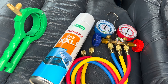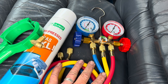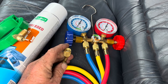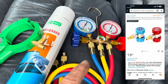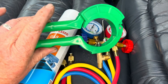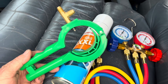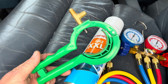This is what we're going to be using to put our gas in. We've got an old set of manifold gauges — only cheap but I've had them a while. They've got the R22/R12 fittings on them. You can get adapters to fit R134A systems, which are a push-fit with a threaded Schrader valve connector. We've got our side puncture can adapter, which I bought from eBay. You can also get them on Amazon or AliExpress — I'll put a link in the description.